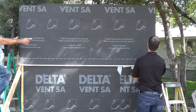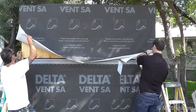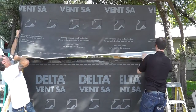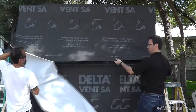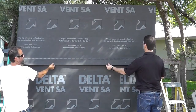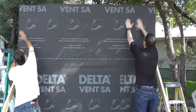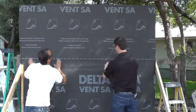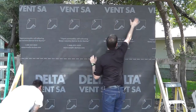Now release that bottom one first. So here's what we're doing — pulling that release liner here, pulling it across. As you can see, this is a fully adhered membrane, which is going to make a really big difference in terms of air barrier for this house. Because now if you think about all those plywood seams behind this product, every one of those plywood seams is perfectly covered.